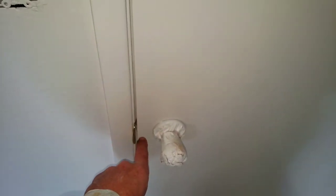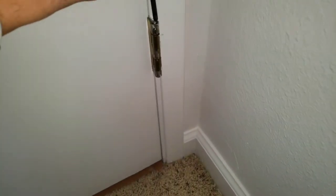When hanging the doors, what I like to do is put the doors up onto the hinges. I don't unscrew the hinges from the door or door frame — instead, I pull the pin out. The door hangs up and the latch plunger keeps it in place. Then you just drop the pin in. It might not drop in right away because it needs to be moved around a little bit.